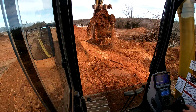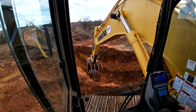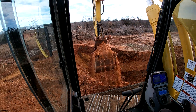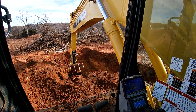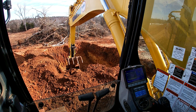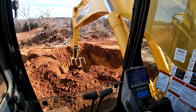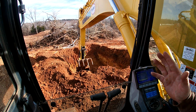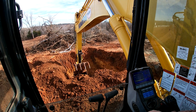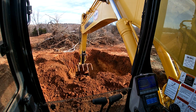It doesn't matter how big or how small the excavator is. Nice, full buckets. But those are some very fundamental operating basics. If you've got any techniques you like or stuff you've learned, leave a comment. I guess you'd call it Excavator 101. Just take your time — as you get better, you can go faster. The less jerky you are, the machine will last longer. You'll be doing less maintenance, because as powerful as these things are, it can be deceiving. They will break just like any other machine.